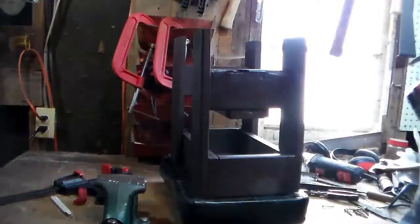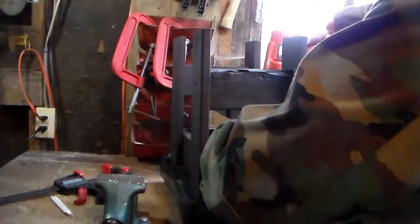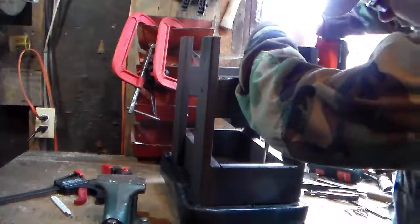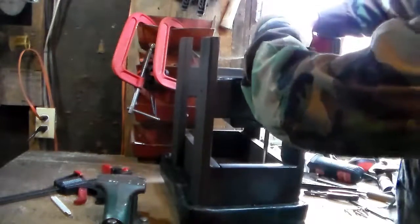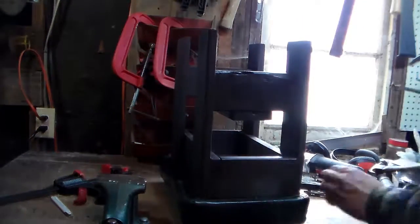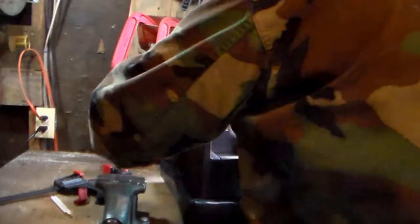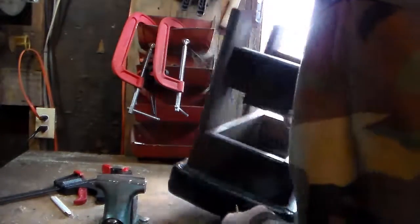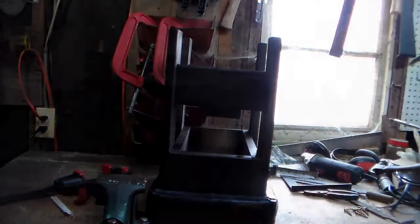The one issue I did have was I had to jerry-rig a longer screw bit for my drill because the 2x4 bracing was in the way. I think if I had thought this through a little better, I either would have installed the seat before I installed the bracing, or I would have moved the bracing closer to the center so that it wasn't in the way. But in the end, this worked out pretty well, and there's 6 wood screws holding it in, so I don't think it's coming off.